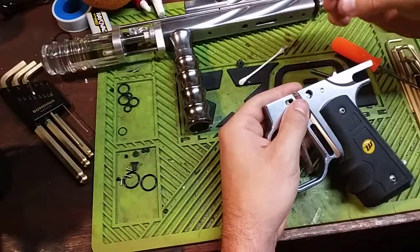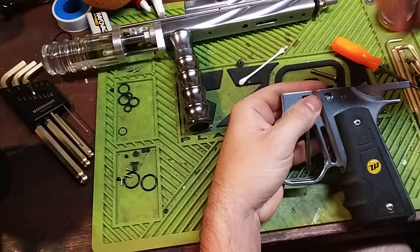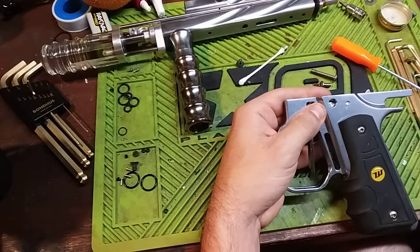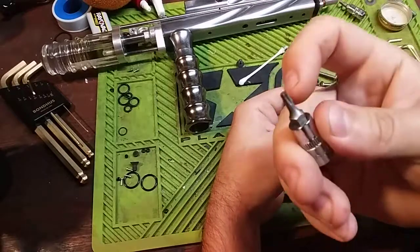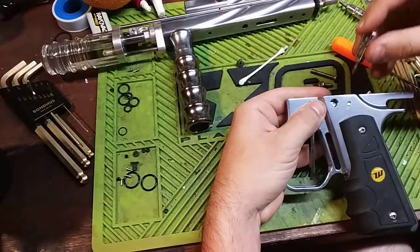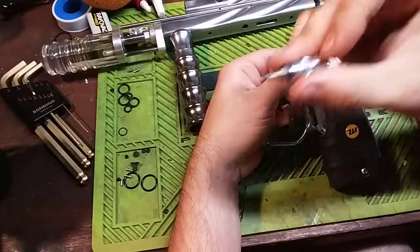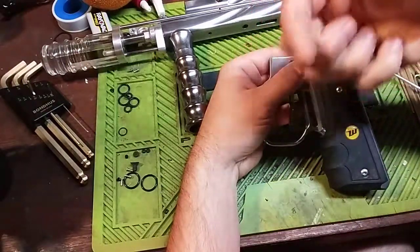What we have to do is get the ball on top of the spring and then press it down into the hole below. Personally, I've used a couple different things, and one of the best ways I've found is to use a torx bit, which has little grooves in the side that help kind of grab the ball so you can work it down in. So we're going to try to grab that ball with the ridges in the torx bit, move it up on top of the spring, press down, and kind of rock it into the hole while lightly pressing on the safety from the back side.